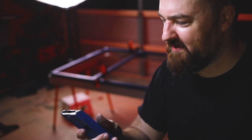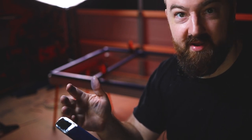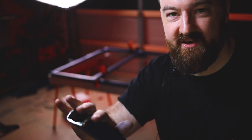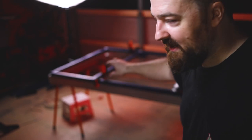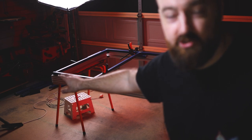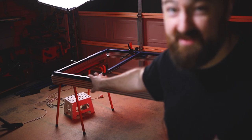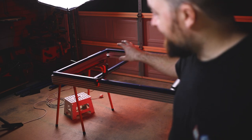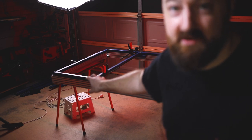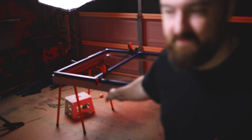I'm not sure how perfect they're going to be, but hopefully my bad welding will help cover it all up. I've gone ahead and assembled the top of the bench and used the C-beam I had spare to help keep it plumb, make sure it's flat, and make sure it fits what's going on top. I've squared it up and mounted it ready to go. I'm going to go ahead and weld the three parts together and also do the other center part as well.